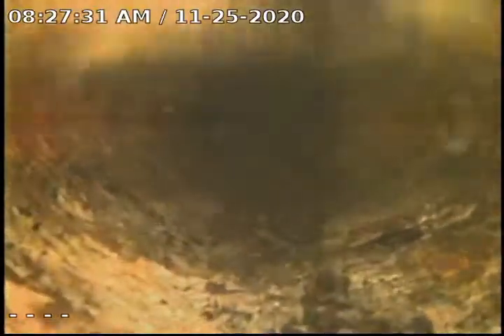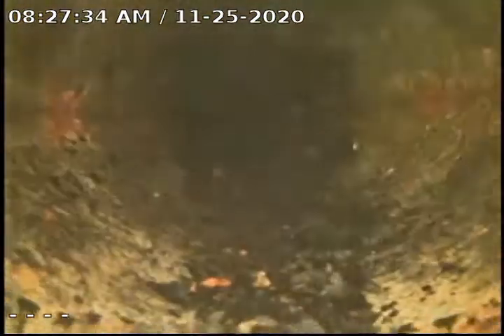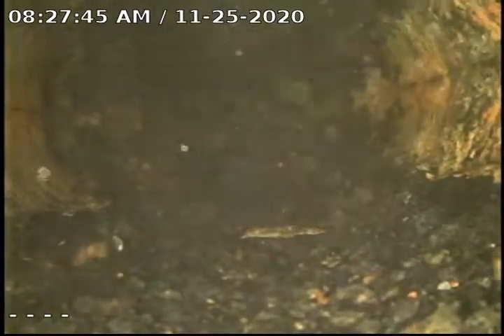As we've run water, you can see here that we're looking at the bottom. This is an area where we're holding water — you can see the bottom of the pipe through here. We're going to push the camera in real slow. It's hard to tell if those are areas where the pipe has actually been broken. This is farther downstream, and again, it's hard to tell if there's just stuff laying in the bottom of the pipe due to a belly, or if it's very possible that the bottom of the pipe in this area is gone.